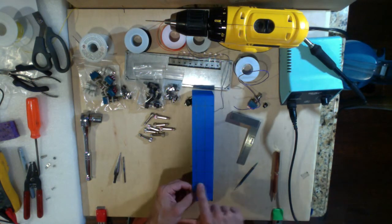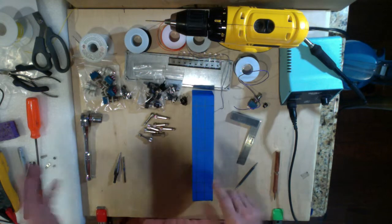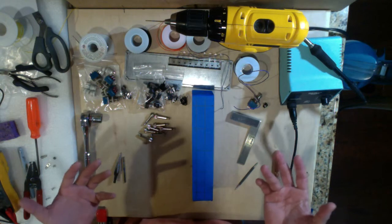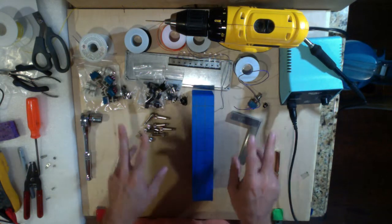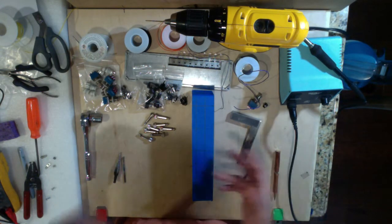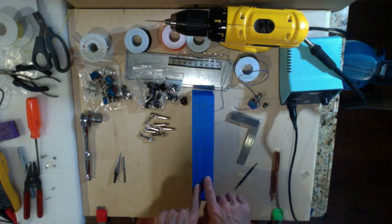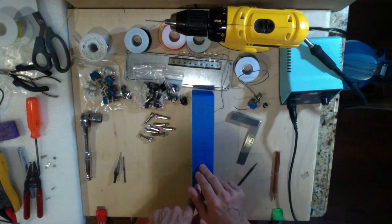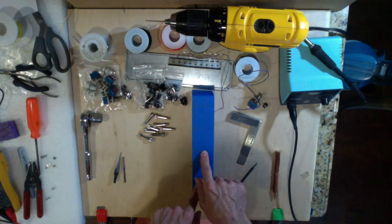Now the other thing that I've placed here is I actually wanted to make a bit of a DC breakout box. Now a breakout box is something that basically takes a line in, whether it be an AC signal like your guitar signal or a DC supply, and then splits it off into multiple outputs. So you got one in and let's say 3, 4, 5, however many out you need. In my case, the pedals that I'm running are vintage pedals for the most part, and they don't require a lot of current. And the power supply I'm using, the 18 volt particularly, has a fairly good current supply, so I can power several pedals off of a single output on my power supply.